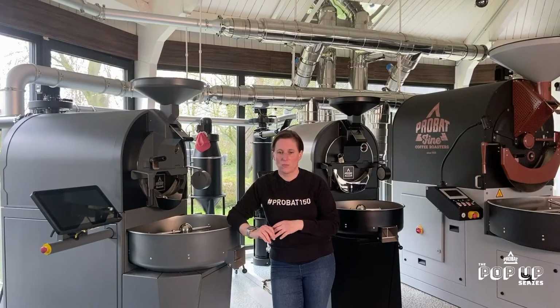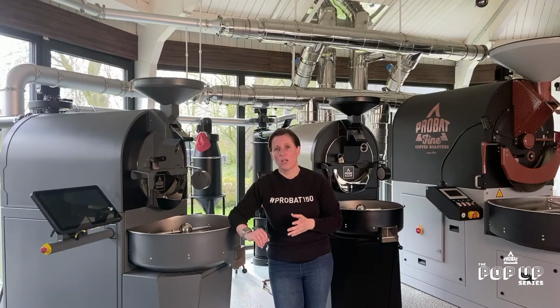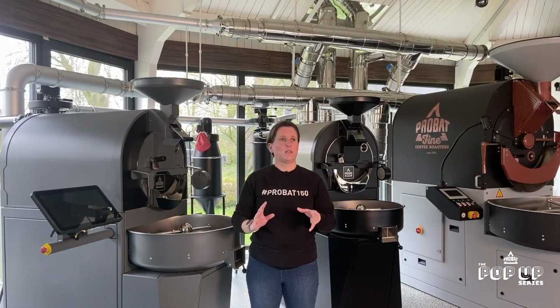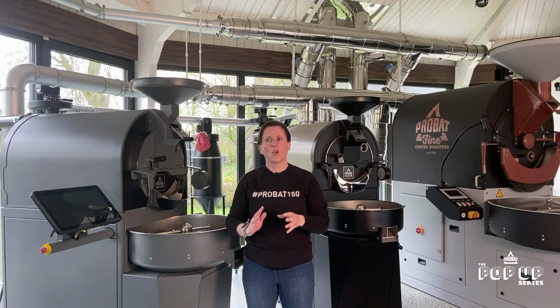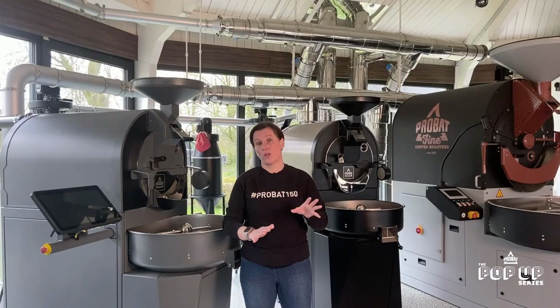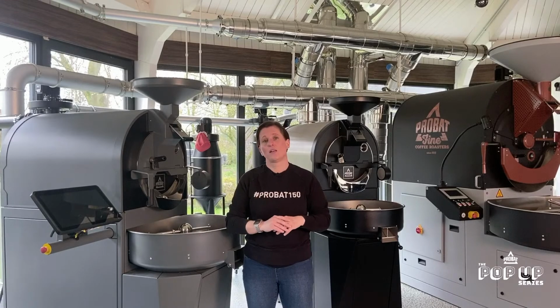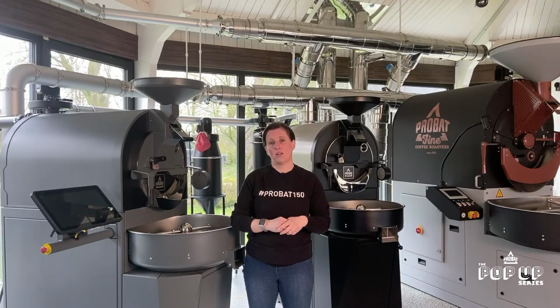Yeah, this is a very good point, because even if you have your new machine and your friend has the same new machine and you do the exact same setup, it's still possible that the machines are not 100% the same in roasting, which is completely normal, as maybe your friend is located somewhere else and has different conditions surrounding the roaster. So if you do comparisons, or if you've seen a cool video on roasting and would like to take the same settings, make sure that your machine can handle this, so that you don't get into a dangerous situation because you took advice from a roaster from a different manufacturer, or with a different age or batch size. Even with the same roaster, if one is located in Emmerich and the other somewhere in the mountains, they will have different behavior even with the same setting. So always make sure that if you compare, the tiny things count a lot.